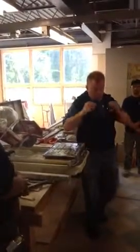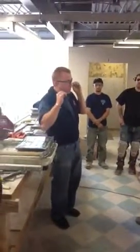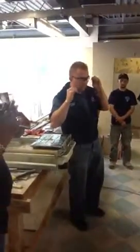Okay? So we're going to put on our safety glasses. We're going to put on our ear protection. When you put on this ear protection, it's important. You twist it small and insert it into your ear. Do not push it hard into your ear, because if there's any debris, you can push it into your eardrum. Okay? So you push it in, twist them, and let it expand.